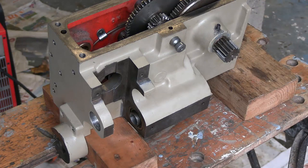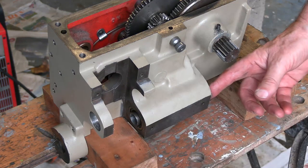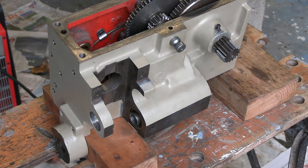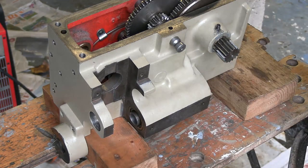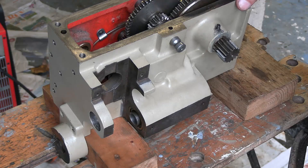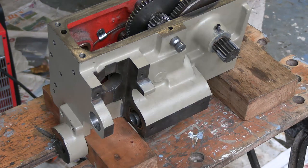The problem with this is that it's very hard to tell from looking at the parts diagram exactly what's inside here. But what is quite certainly the case is that there's a shaft seal here, and a shaft seal here, and I guess some bearings in there. I can see no way of getting these shaft seals out other than by hooking them out in a destructive manner. Since it seems to be perfectly okay in terms of pre-turning, I thought I'd leave it as it is - at least until I see whether it's leaking or not. My plan now is to put the base on, fill it up with oil to the specified level, and see whether any oil leaks out of here. If it does, then I'm forced to disassemble it, but if not, I'm going to leave it alone.